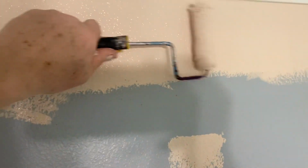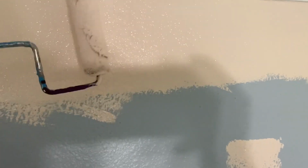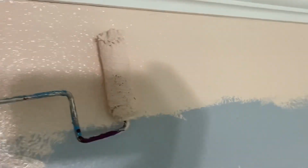And then watch this. Look, I'm down here. Watch this. I lift off. Not like this. Not like this, but like this. Like an airplane. This way, you feather in this section of the paint with the one that's setting up. And you never want to roll backwards on accident. Imagine an airplane taking off, went backwards, what would happen? Oh, forget it.